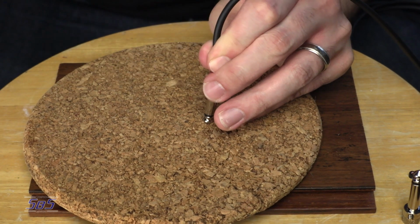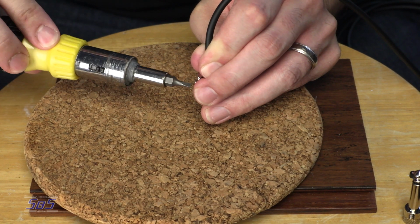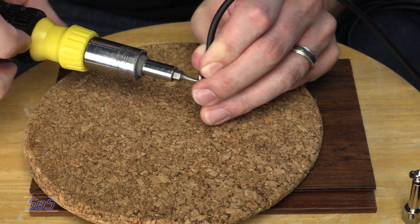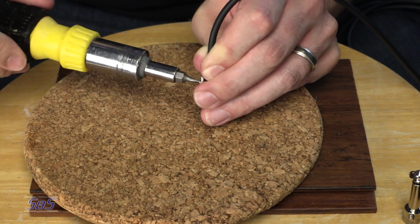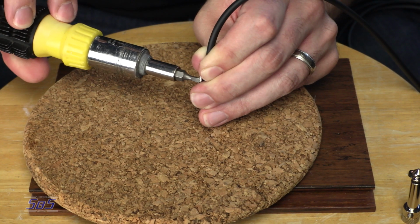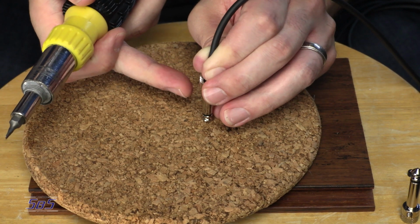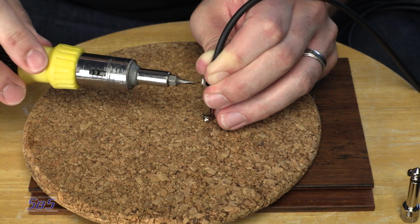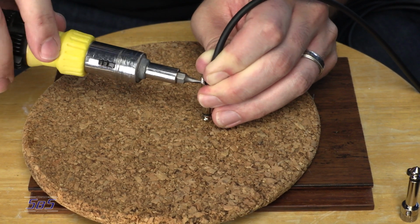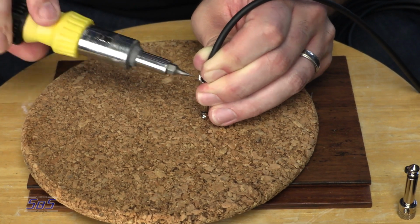Now you're gonna wanna keep applying downward pressure onto the connector with the cable while you set in the set screw. And this is where I was making a big mistake in my first attempts at building cables with this kit. With similar products, they tell you to basically screw in the set screw until it's flush with the connector. However, Albert and I discovered that in order for the set screw to make proper connection with the grounding inside the wire, you need to screw it in much tighter and much deeper than you might think.